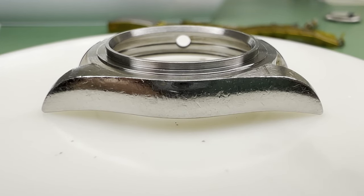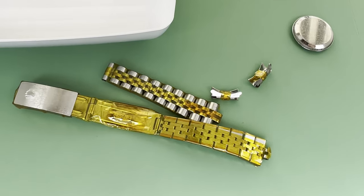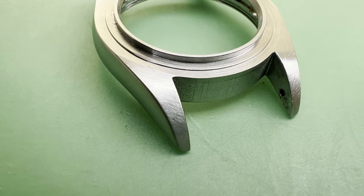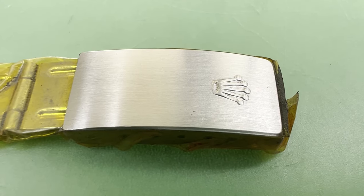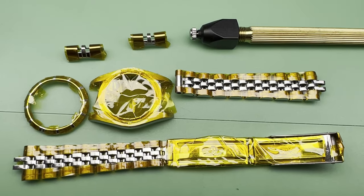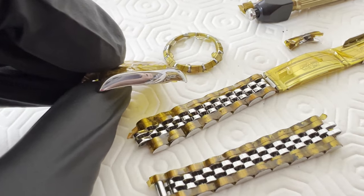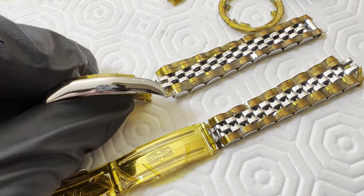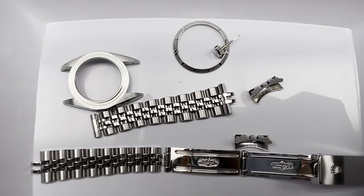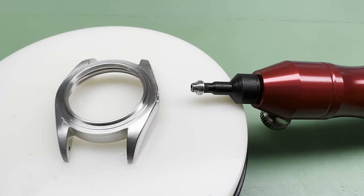We start the refinishing by preparing the polished areas and reapplying the brushing. You can see that the major imperfections have been removed using a low-grip brush stick. The areas to be polished are covered with thermally resistant tape, and the brushing was reapplied to the lugs of the case, the end links of the bracelet, the top of the buckle, the first and fifth links of the bracelet, and the case back. The tape is then removed and fresh tape applied to the newly brushed areas in preparation for polishing. Then, over a series of four polishes, the centre links and sides of the bracelet, sides of the case, pips on the bezel, the crown, the centre of the end links, and the sides of the buckle are all brought to a high shine. After all of that, the case parts are cleaned again in the ultrasonic machine, and we'll reassemble the case to give it a water pressure test.